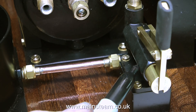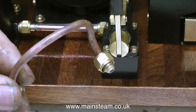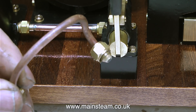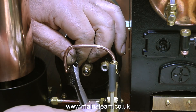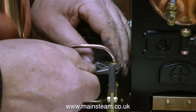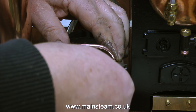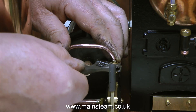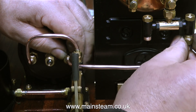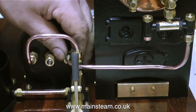Time now to start the piping. The pipe between the pump and the water tank is okay - I polished that up as I made it. The rest of the pipe had just been cleaned with a piece of Scotch-Brite after silver soldering, so now it was a polishing extravaganza. I didn't show the polishing spindle operation in this video because in my video called 'How to Silver Solder for Beginners' I feature the use of a polishing spindle.